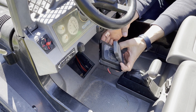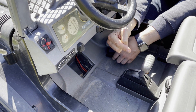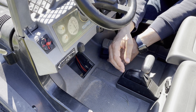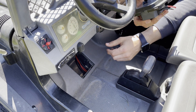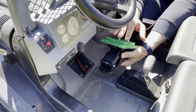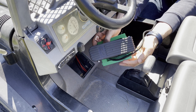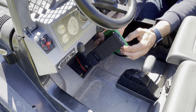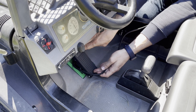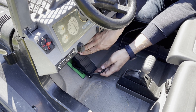Here's the original pedal — it's just a switch. It lives in this bay and it's connected to the gear stick, which has reverse and two forward positions. I'm not going to be using that one in this build. Instead I'm using this pedal, and I've made a copy of the original mount but with a wedge so the pedal is mounted at an angle. This makes it a lot more comfortable to press down, otherwise it would be almost flat — not comfortable. Like this, pretty good.